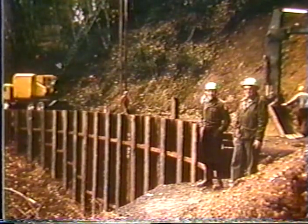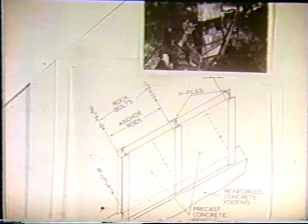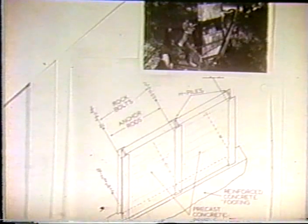structures. You've got to be careful, again, like I mentioned, to get them into firm foundation and not make them too high, because then you've got to tie them back or do some additional structural analysis to make sure that the vertical element is sufficiently strong to hold back the soils. If they get very high, then of course you can add anchors at the top, as illustrated in this lower portion of the slide here, in the graph portion of the slide, to provide additional stability.